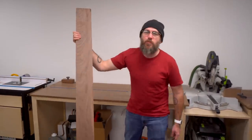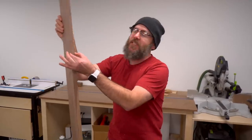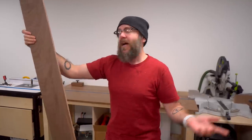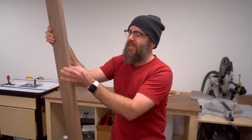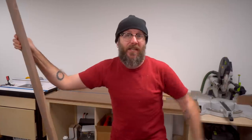I got this piece of three-quarter inch walnut — we're going to use this for the top. I don't want it three-quarters of an inch thick; I think a half inch will work fine. I could just plane it down, but I'm going to re-saw it first, and that's going to give me a thin veneer I could use in a future project. Save the wood, respect the walnut.